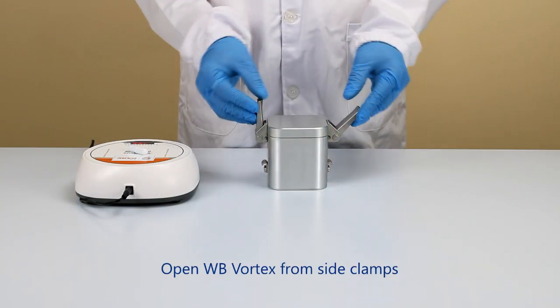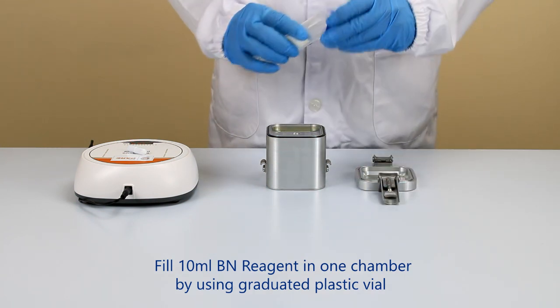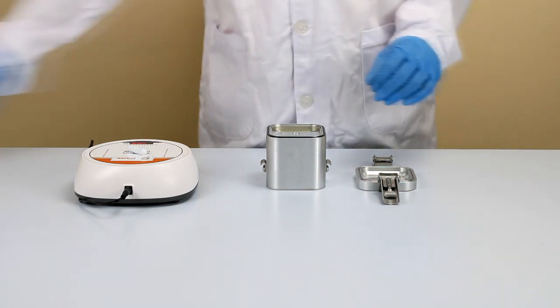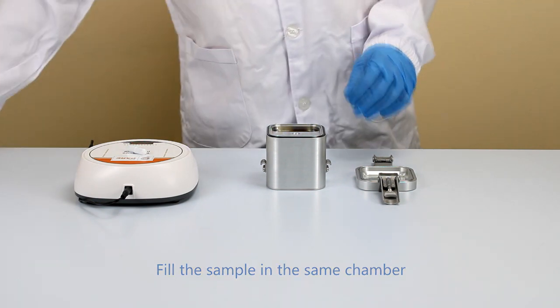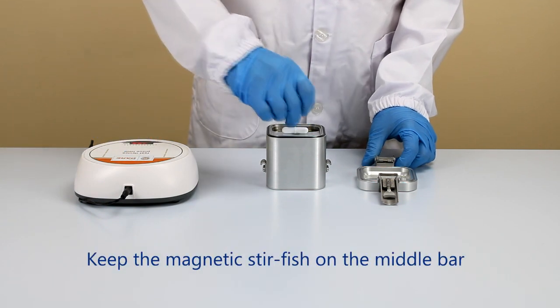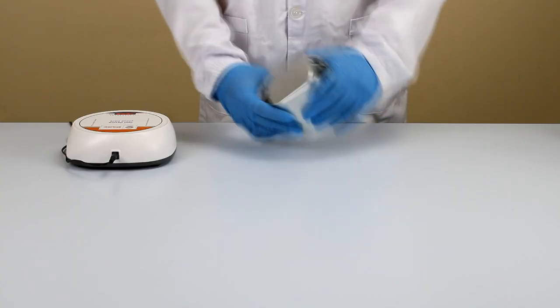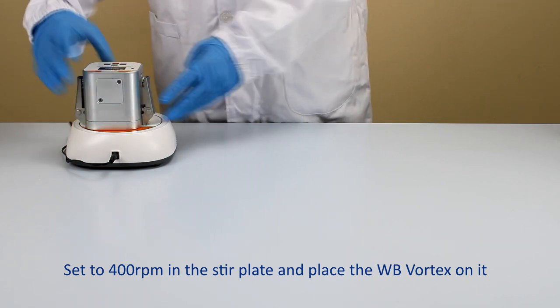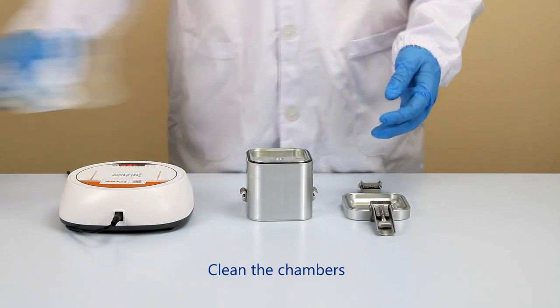Turn the device back around and open the WB Vortex from the sides. Measure the reagent and transfer it into one chamber by using a graduated plastic vial or the supplied syringe. Take the appropriate sample using a syringe and fill the same chamber containing the reagent. Keep the magnetic stirfish on the middle bar and close the WB Vortex. Set to 400 RPM on the stir plate and place the WB Vortex on it. After three minutes, the BN Ref step one of three value will appear on the display. Press the green key to continue, then open the WB Vortex from the side and clean the chamber for the next sample.